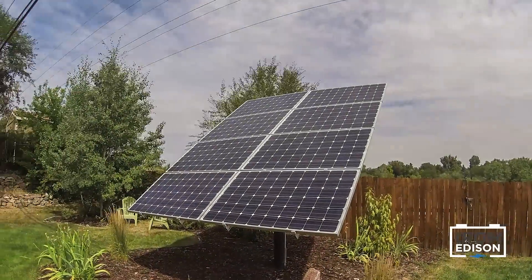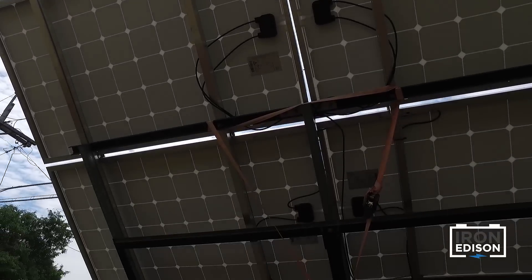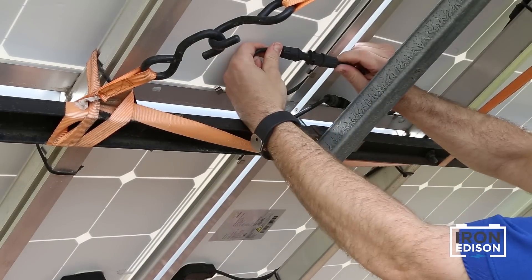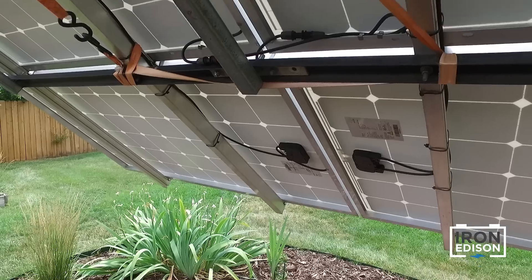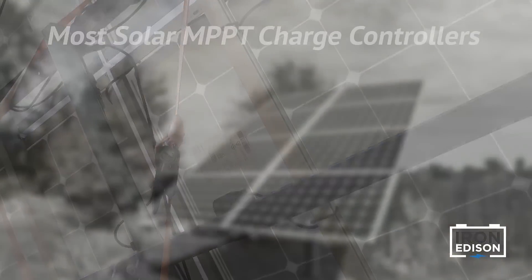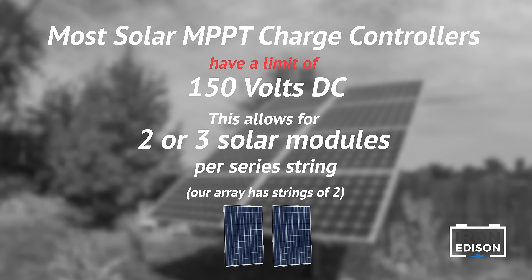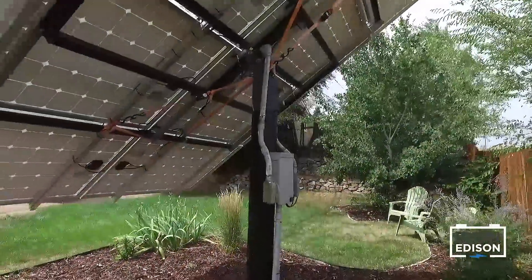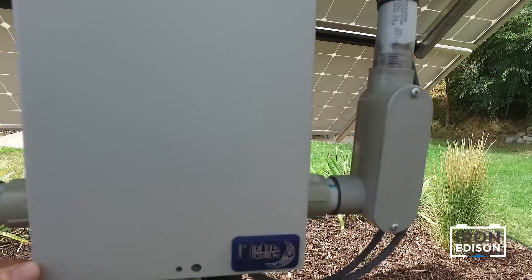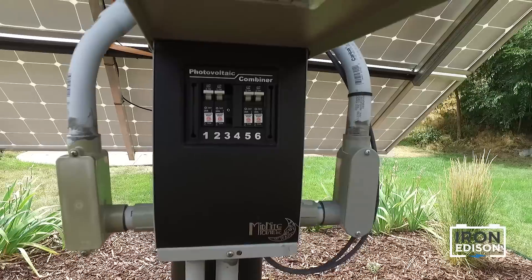A solar array is made up of solar modules wired in series and parallel to build desired voltage and current. The solar modules connect together through special connectors. These ensure a proper, safe connection and can only be disconnected by using a solar cable tool. Connecting the positive and negative leads together builds voltage in a series string. Most charge controllers have a limit of 150 volts DC, so no more than two or three solar modules are used per series string. The end of each series string lands in a combiner box. The positive ends of each solar string go through a breaker, mounted on a DIN rail inside the combiner box. This allows each solar string to be safely disconnected out here at the solar array.